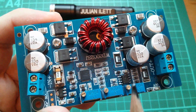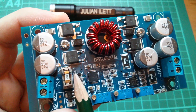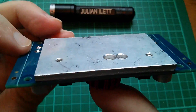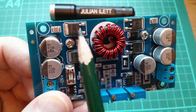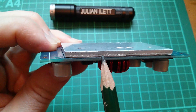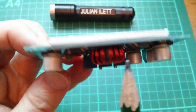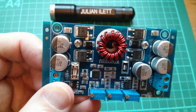A couple of other notable features on the board: there's a miniature 15-amp fuse in a fuse holder, and behind the four MOSFETs and the inductor there's a heatsink — just a slab of aluminium. There are presumably thermal vias under the MOSFETs feeding heat through a silicone pad to the aluminium heatsink. Running this at about one amp, I noticed no temperature increase on the heatsink, the inductor, or the MOSFETs.